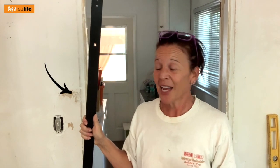So these are all great notes for you guys, and I'm so glad I installed a barn door before doing this video because I did learn a lot. The barn door track, it's not forgiving, not in the least. You have to make sure you're completely level. If the track's even off the slightest, your barn door is just gonna roll open ever so slowly. You gotta get yourself a level and make sure you're completely level when you mount that track. Everything about this installation hinges on this track. Now that you know that, we're gonna prepare our level lines, measure our door, and make sure we hang our track in the exact spot that it needs to be hung.